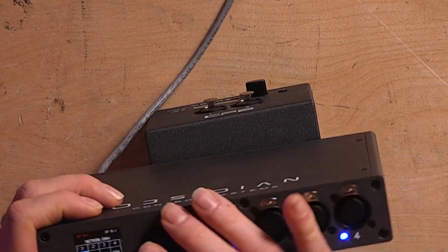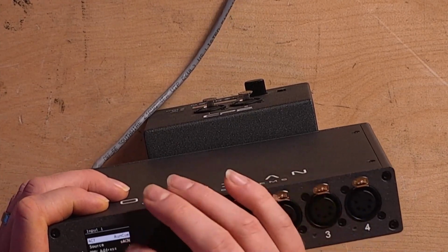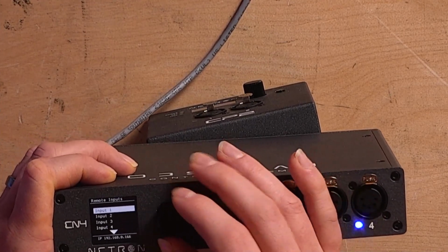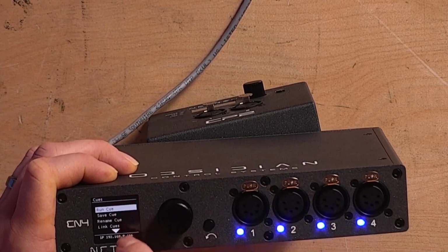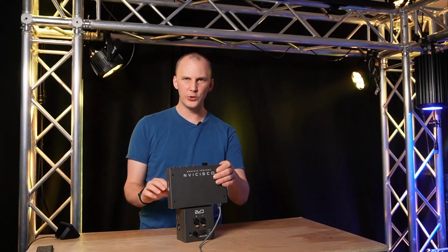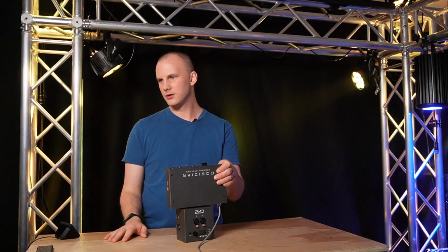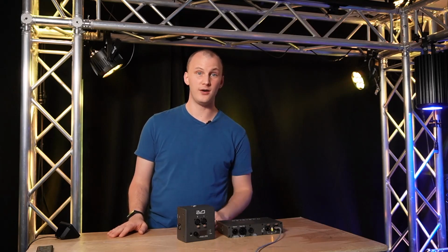So there are also the remote inputs, which actually allow you to take data from sACN, an individual channel, and you can fire internal cues that you saved. So these internal cues, if you go to cues, are in here. You have run, save, rename, and link. Okay, so this allows you to actually save whatever data is coming through the node as a cue, then unplug the console completely, and set this up to just be fired by a basic DMX command. Okay, so that might seem kind of out there.